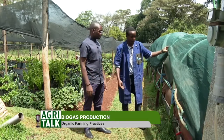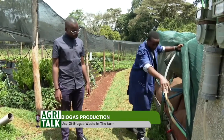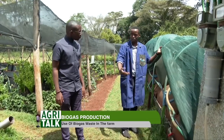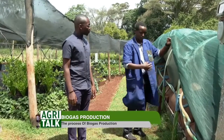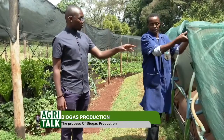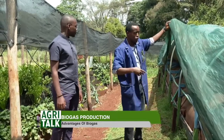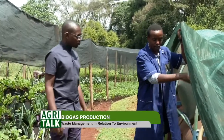Yes, they serve the same purpose. This lower one, the red one, is tapping gas from that section of the digester. Because gas production happens all the time, all the balloons are swollen this way and gas production is still happening. So excess gas is stored in the upper storage balloon. When you want to run machinery or do things like chicken brooding, you can run it off the stored gas, and then you use the other gas for other uses.